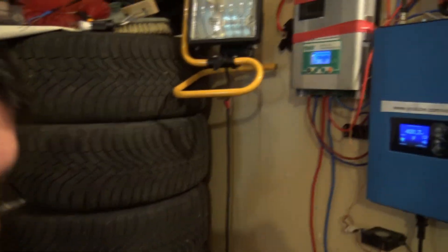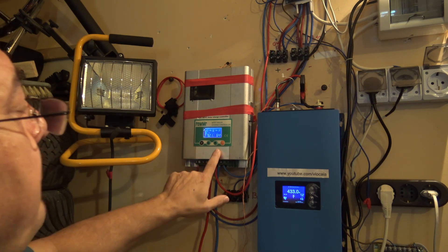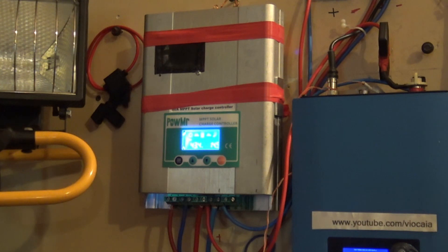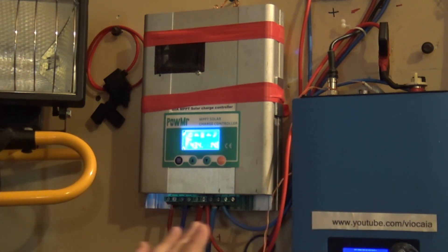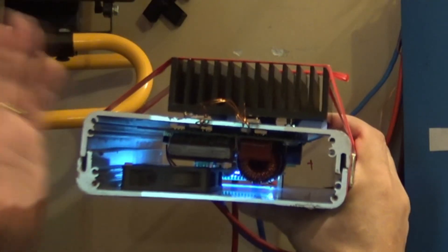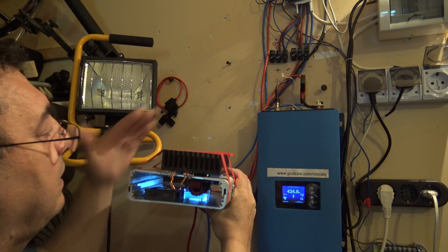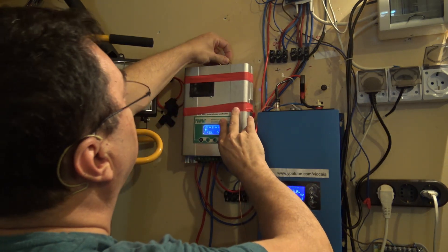Let me talk about the MPPT, because one of my viewers mentioned it's a great device — and yes, it is. But previously it had an easy job: charging my 12-volt batteries in the original install, rarely passing 7–8 amps. No extra cooling was needed. Now in this new configuration it can easily reach 30 amps or more. As an improvisation, I had to add an extra heatsink — it doesn't look great, I know. I put some thermal pads on it, which you may have seen in my earlier videos, and it's doing a great job keeping things as cool and thermally relaxed as possible.